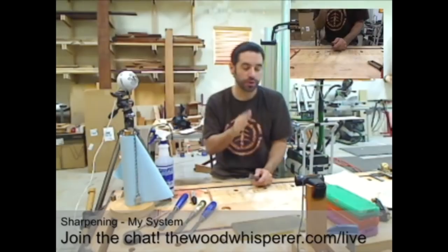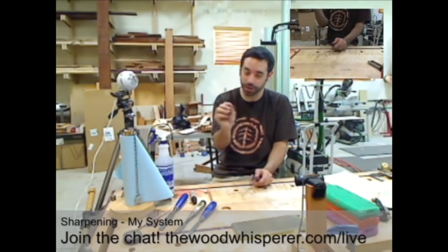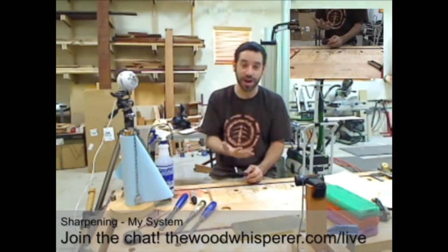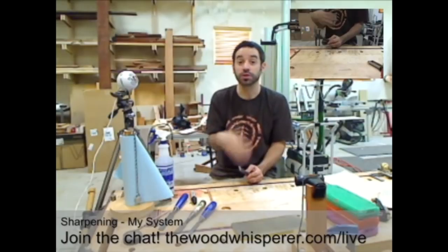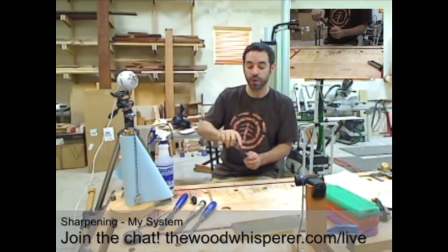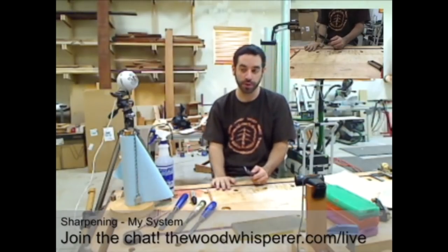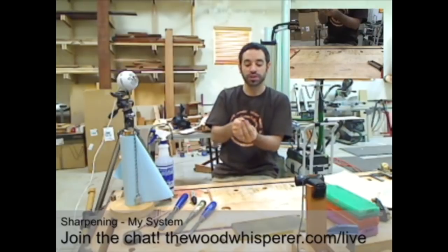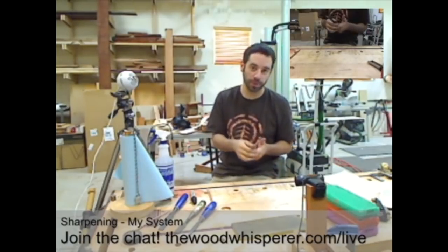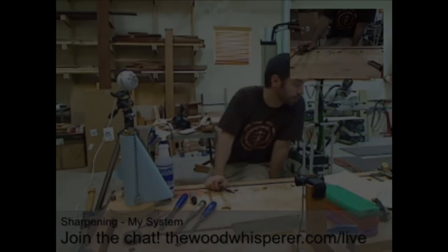So you know how I sharpened the secondary bevel here, and I really only focused on that very little tip at the fine grit? I didn't sharpen the entire primary bevel to 8,000 grit, because you don't need to. The same thing applies on a system like that. If you have the bevel mostly sharp and relatively smooth at whatever degree you want, you could then go to a strop and just hit that secondary bevel at that really high grit and get a razor sharp edge from it. So it's perfectly legitimate. I just don't really do it myself.